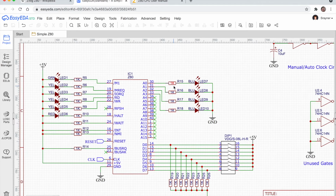So the absolute maximum we're going to be drawing on any of these pins is 5 milliamps, which is not that much, although it's still a little bit. But once we've got the LED in there as well, which is going to drop at least 1 volt, probably more like 1.5 volts, or even as much as 2 volts, depending on the color of the LED, we're going to be nowhere near that 5 milliamps. We're going to be definitely under 4 milliamps. So I think this is safe.